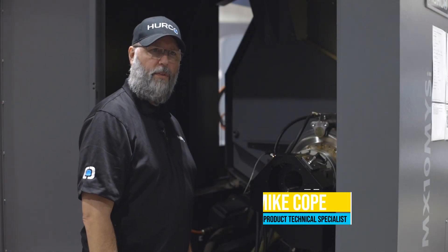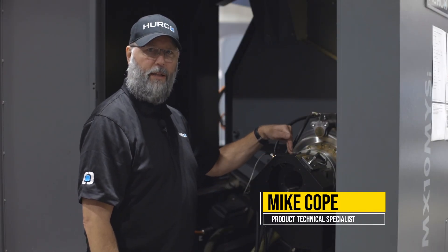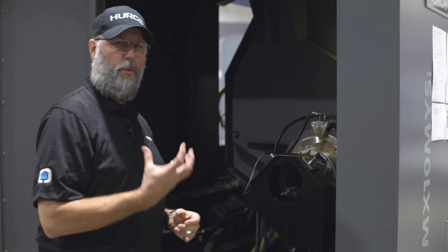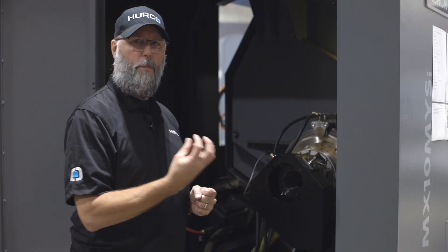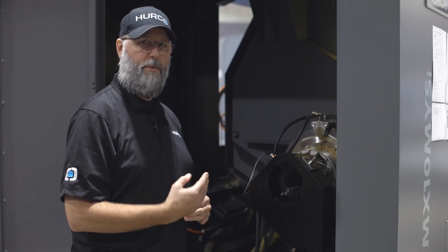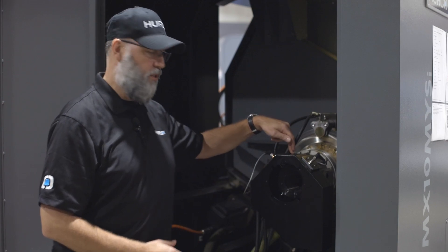In this video I want to cover the proper setting and operation of the clamp and unclamp proximity switches for a lathe. We had a couple questions recently where a customer would clamp up on a part and the machine would tell them that their chuck is closed, no part present. It turned out to be about understanding the stroke limit of the machine's chuck and how to set these proximity switches.